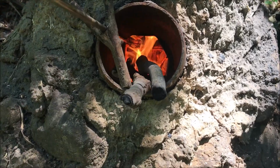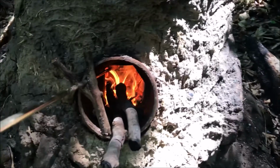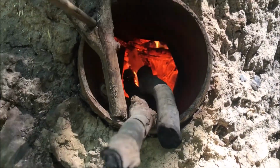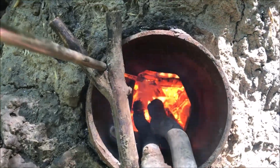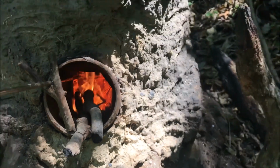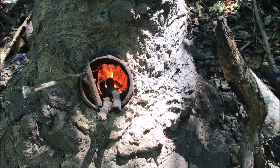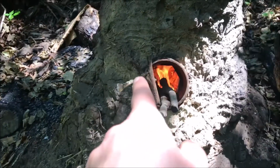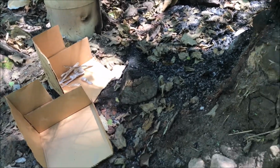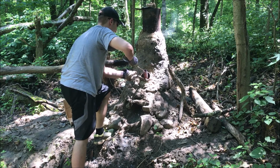All right guys, so top is still halfway covered. I'm drying out my mold right there, and the container, the crucible, is red hot. And if I look above it, which you can't see right now because there's a stick in the way, I don't see any of those little shards of aluminum sticking out like they used to. So I'm gonna go ahead and back up, pull this thing out, put my gloves on of course, pull the crucible out, and then drop some new shreds of aluminum in there to fill it back up. Oh, I can see the liquid in there. Sweet.